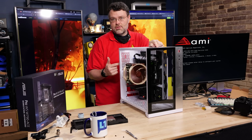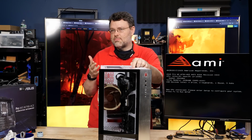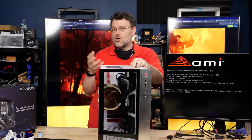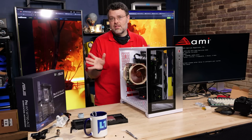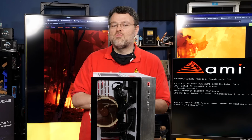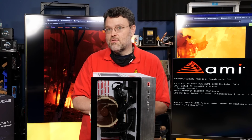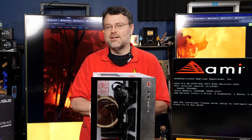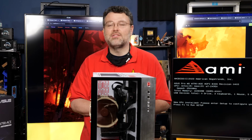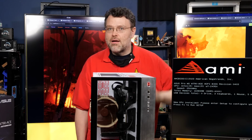This power supply might be 12.00 volts, and the other one might be 12.03 volts, and unless the resistance between the power supplies is balanced correctly, a lot of current can flow from the difference between 12 volts on one side and 12 volts on the other. Okay, I'm leaving a lot out and really oversimplifying, but the motherboard designers really have to be careful when you're doing this dual power supply thing, because it's like the days of yore when you had a multi-rail power supply, wherein ultimately we decided, it's not a great idea. In this case, multiple rails come from different power supplies. So again, it's a lot of exposition to just say, be careful, follow the diagram.